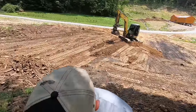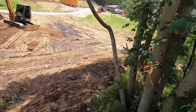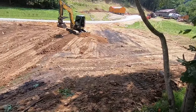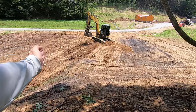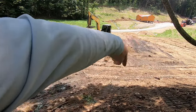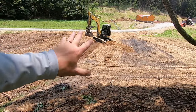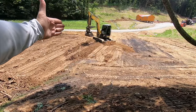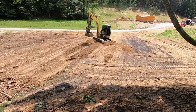And also, if I can get you guys set back up here. Right there. Okay. So I'm going to split the difference. Half of that dome is going to come back this way because this really dives off. And there's a holding area there where water's just going to sit. So watch and see how I move material from over there, and I just cut a straight plane, and it'll be nice and smooth for water to run exactly where I want it to.